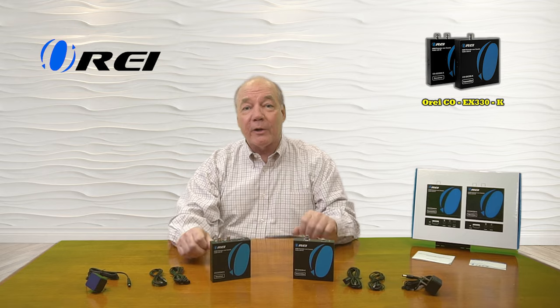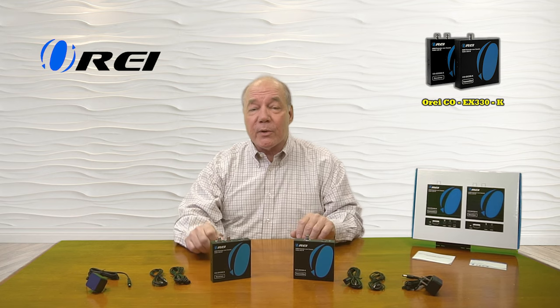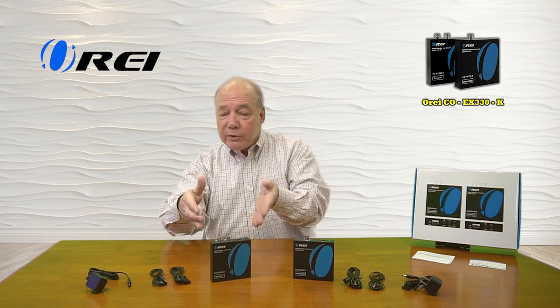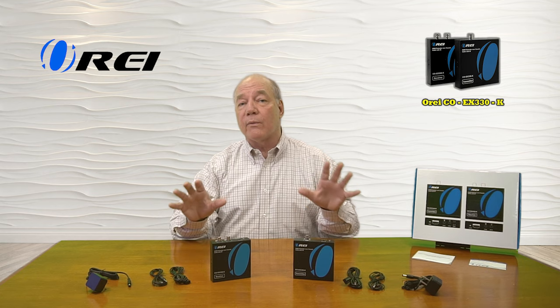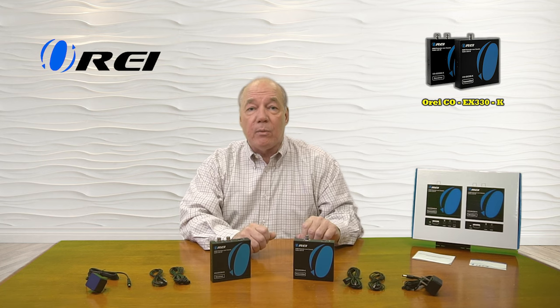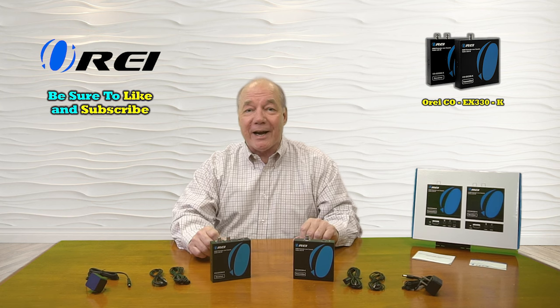I hope you found this overview of the O-Ray CO-EX330-K HDMI extension kit helpful. This product was engineered to make it incredibly easy to share all of your HDMI media content with a remote location up to 330 feet away over a single coaxial RG6U cable, which provides increased reliability and shielding — making it the perfect choice for both commercial and residential installations. You can cascade multiple receivers off a single transmitter to create an entire network by simply daisy chaining receivers. The infrared blaster kits give you complete control over the content, the product fully supports 1080p HD content and is HDMI 1.3 and HDCP 1.1 compliant with eDID switch settings for a wide variety of media. Everything you need is included with the kit, and with a few simple connections you can be up and running in no time. Until next time, thanks for watching.